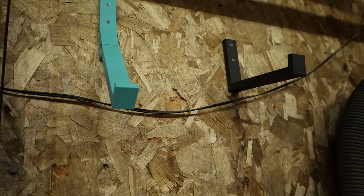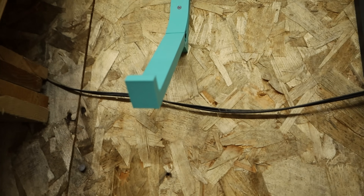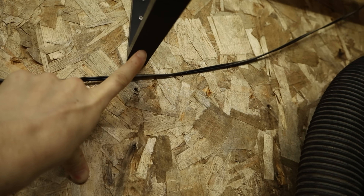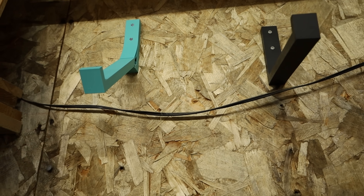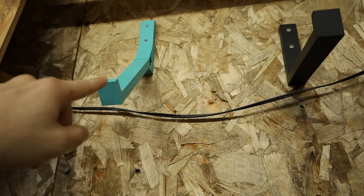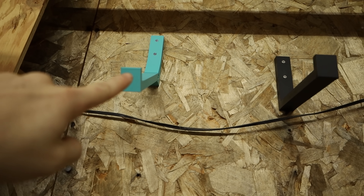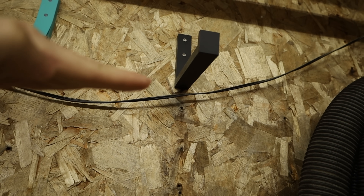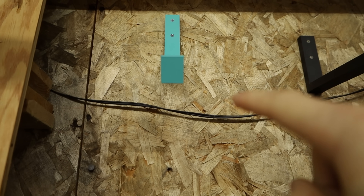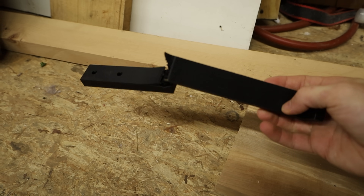So we've got failure right there — haven't touched it yet. We can see this is definitely sagging and it's not a 90 degree angle anymore. Both would have performed better with a bracket or angled piece at the bottom to prevent this. But this is the same result we've seen with both the glass fiber version of the HT PLA and the non-glass fiber version. This is Elegoo PLA. I printed these models specifically because I wanted them to fail. I thought they'd more gradually droop down, but I guess we have our answer — the glass fiber HT PLA did the same thing.